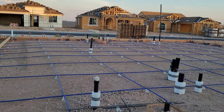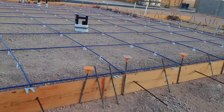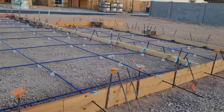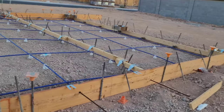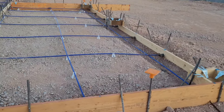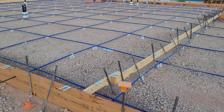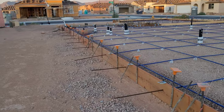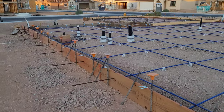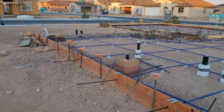You can see the other parts of the foundation here — it's pretty cool and fast to put together. The nice thing about the South is you don't have basements. I grew up in the Midwest where you have basements, and it always seemed like basements were nothing but problems — especially if you get cracks, you can have flooding issues and mold issues if there's too much condensation and it's not airing out properly. With the post-tension foundation, your issues are usually pretty minimized.